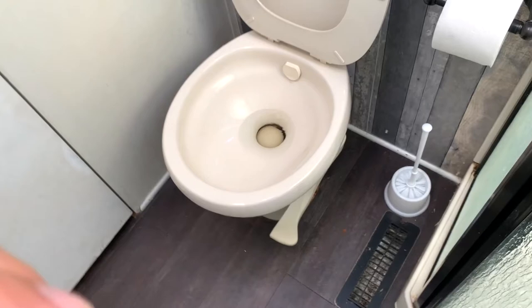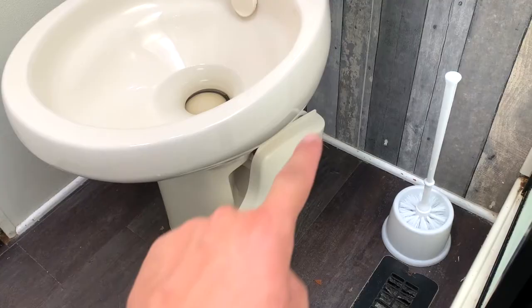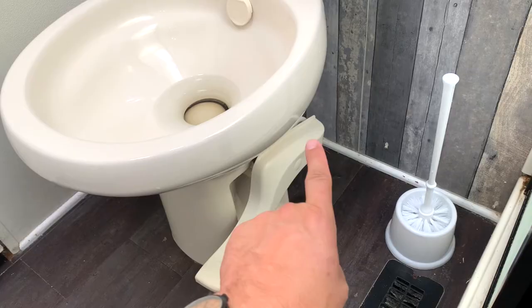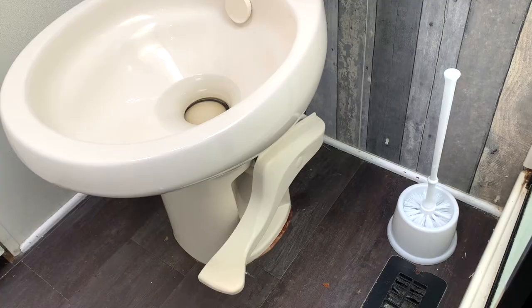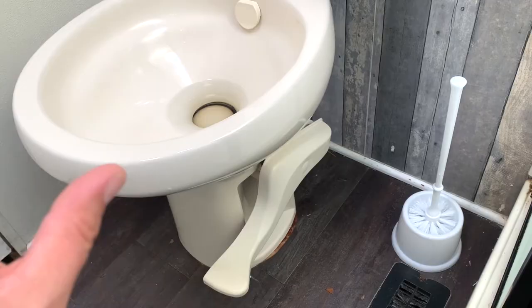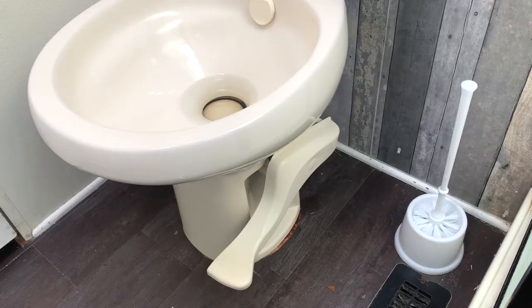In the meantime, you have to actually pull up a little on that handle to get it to stop. Behind this pedal that you push your foot down on, there are actually three mechanisms. One of them opens up that valve we talked about, but the other one right back here is the water valve — it controls the water that comes up from the tube and out of this piece right here. That is the second kit you're going to buy. I would suggest, and this is from experience, that if you're going to replace one, replace both. They're really connected. It's only about 20 more bucks to get both kits, so I would highly suggest you do both repairs all at once.